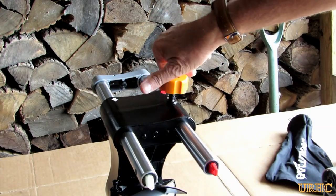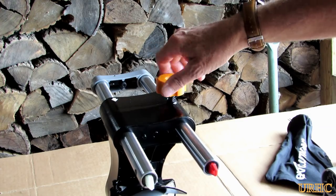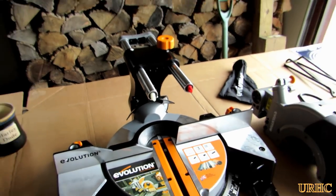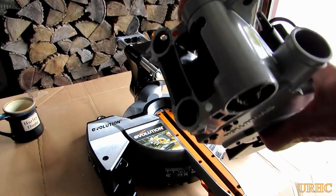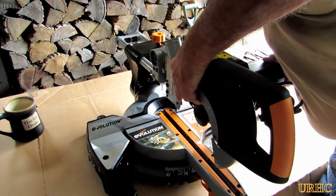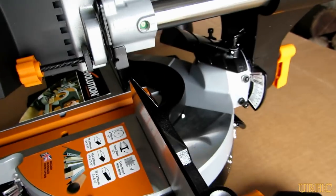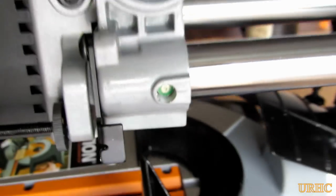You have to put a little locking screw in there to hold it in place while you put the head on. They've got some little locators that get pushed in and lock the head on when it goes together. You just have to make sure you've got the red dot and the white dot aligned, and it just kind of pushes on. You hear a little click when it's all the way back, and you can double-check by looking in the little holes to make sure the pins popped out and locked everything together.